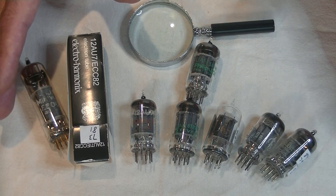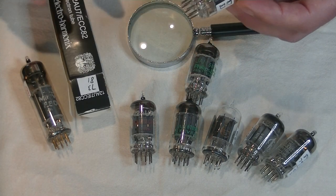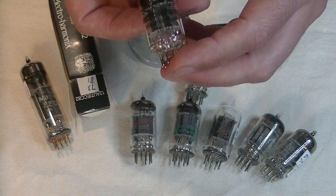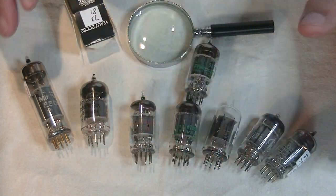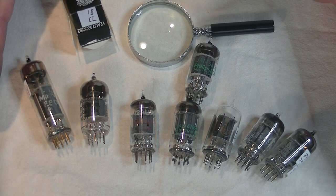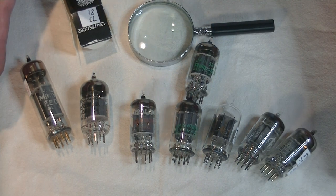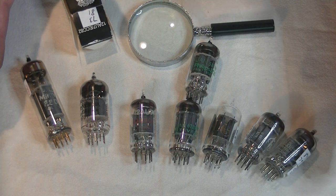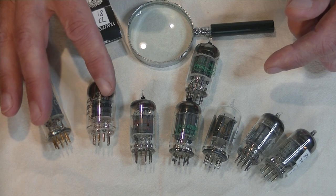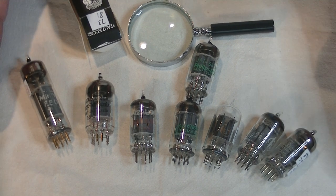Let's take a quick look at a current production 12AU7 — Electroharmonix, what they call the 12AU7 EH. Electroharmonix makes good, solid, reliable tubes; I've never had one fail in service. The bass was okay, mid-range was okay but maybe a little thin, especially compared to the Sylvania JAN 6189 or the 5814. Top end was present but lacked some of that special sparkle. However, it was a low noise, very low microphonic tube — and that may explain the lack of top end sparkle. It's a nice dynamic tube, reliable, and affordable.